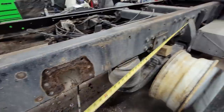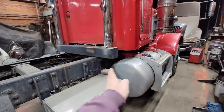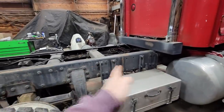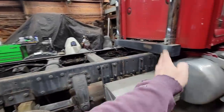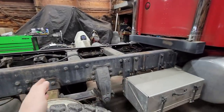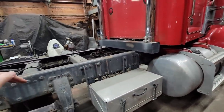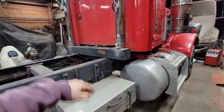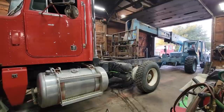52 inches. So we are effectively adding about 50% more length in here. So we're almost, not quite doubling, but 1.5 times. We have 1.5 times that distance that we used to have. So that makes this belly, as we call it, a little more susceptible to twist, to flex, to cracking, all that stuff. So we would like to improve upon the strength of this.